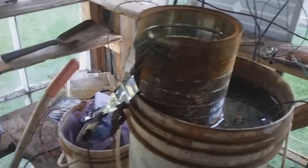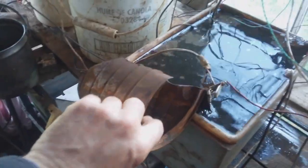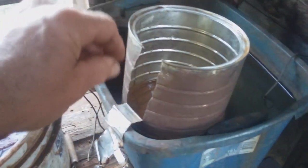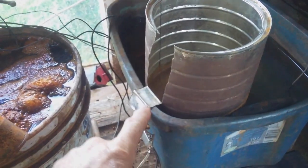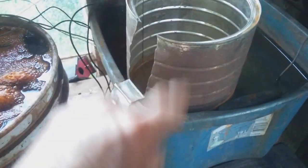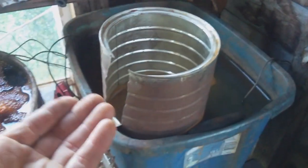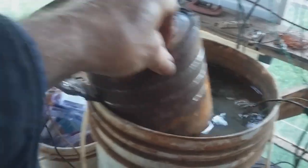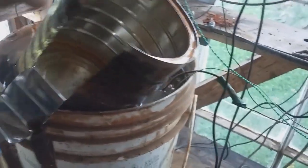Next you need a sacrifice object — iron that will disintegrate. I use blades and all kinds of stuff, but the best is a paint container or coffee can — that's the top best. That's what they look like after a few days — they totally fall apart. The best way to attach them: cut the side to the middle, use it as a hook, put your contact to it, and when the bottom part is used up you simply flip it and reattach.